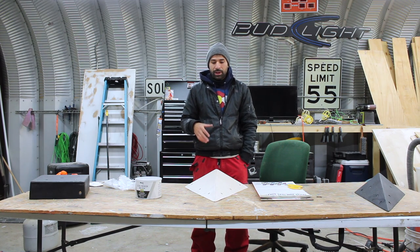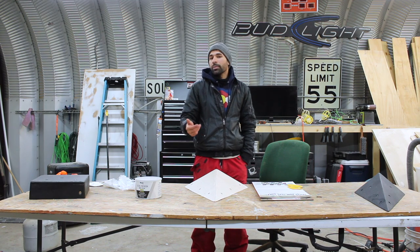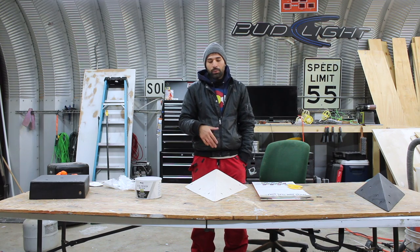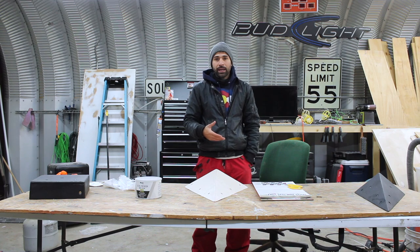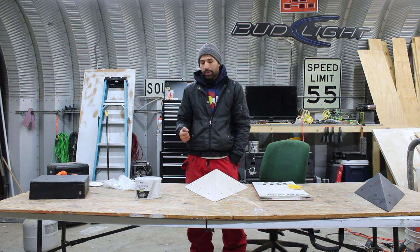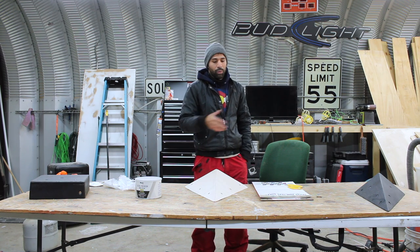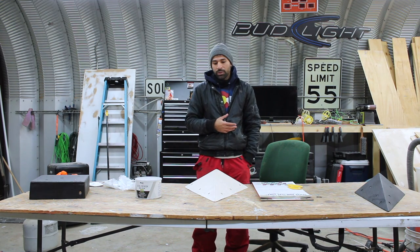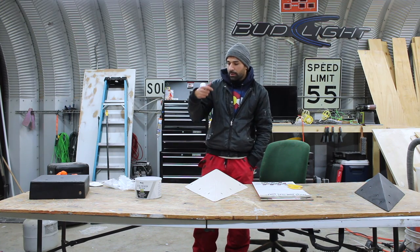and a lot less cumbersome when sticking screws and stuff in it, as opposed to the other option of sticking wood internally. With that wood method, it requires a little bit more cutting and a little bit more mess as opposed to the fiberglass. It also requires more screws and more wood filler. So overall, the easiest way to do reinforcement, and the cleanest, most professional way, is fiberglass.